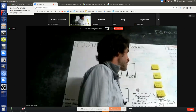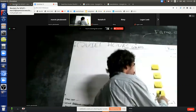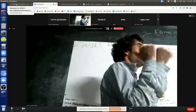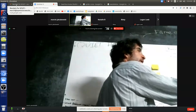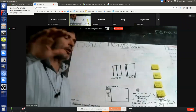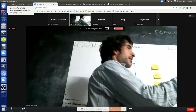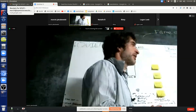Now, if we talk about the minimum critical requirement, after the top plate, that blocking is questionable because I would suggest we do the blocking, which has insulation behind it in the other house, which isn't done. So here, all we would need is the floor platform. And then we could even question, since we've got a carport and second story door, do we still want to do the stairway cutout? Because it's more work. Of course we can do it, but I was thinking about it today.